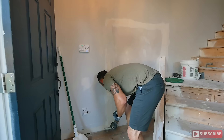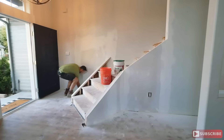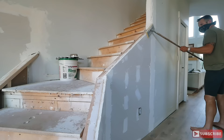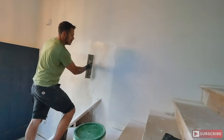Apply a first coat into the joints themselves and then lay the drywall tape down on top. Follow with your taping knife applying a skim coat of compound over it. Let that dry overnight. Once it's dry, come out, sand it a little, and then start applying a wider section onto that taping area. Sand all the edges with 150-grit sandpaper using a pole sander.